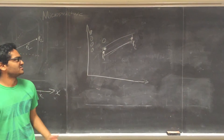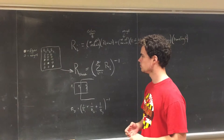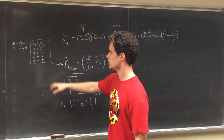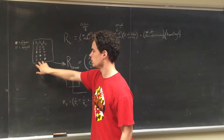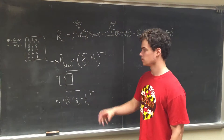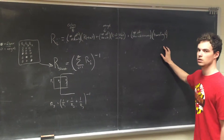To model the electrical resistivity of our material, we first took a line scan of each line in the sheet, treating each line as a series circuit. We then considered each line as a parallel circuit relative to each other, so we added up the reciprocals and then took the reciprocal to get the total resistivity.